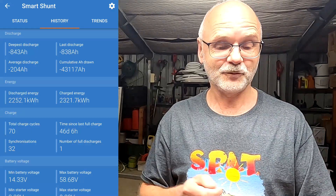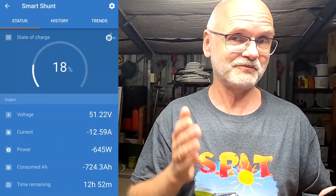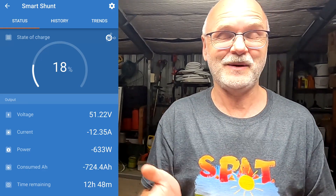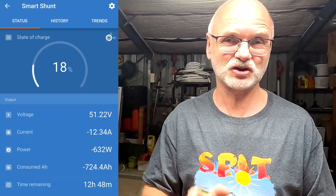The more devices you have measuring your state of charge, the more results you will get — and they will never match unless you fully charge your battery. In our smart shunt history we can see it was 46 days ago when we last fully charged our battery. If you have only one battery with one smart BMS, you can use that to determine state of charge. But as soon as you have more than one battery in parallel you have a conflict — you don't know which reading is correct. I've got three battery banks in parallel, so I decided to keep the Victron Smart Shunt as my main point of truth. I don't give a red shit what all the other smart shunts in the BMSs show.